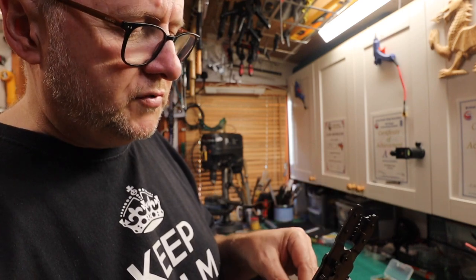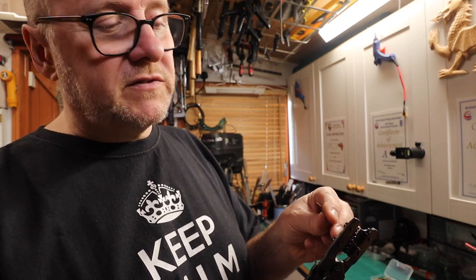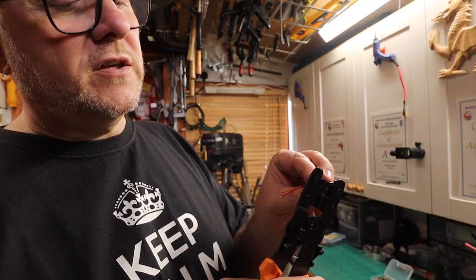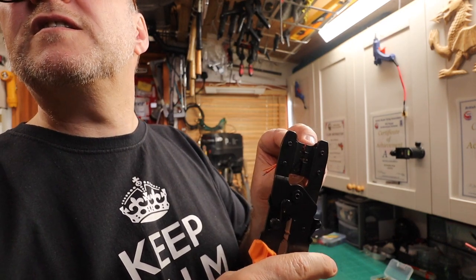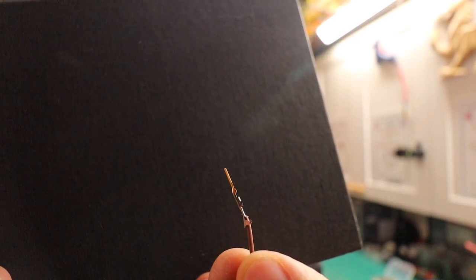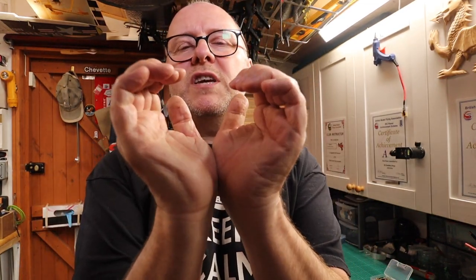There are two crimps you're going to do with this particular type — one for the wire and one for the insulation. They will be different sizes because the wire is thinner without the insulation. So you just offer it up, put the wire in, and squeeze it. When I look at that joint now, the insulation has not been crimped, only the wire. It crimps in onto the wire and traps it. The crimp starts off open, and as you squeeze the crimper it forces the wings around, and they come in and crimp into the wire. It's a good idea to sometimes twist the cable as well so it grabs multiple strands.